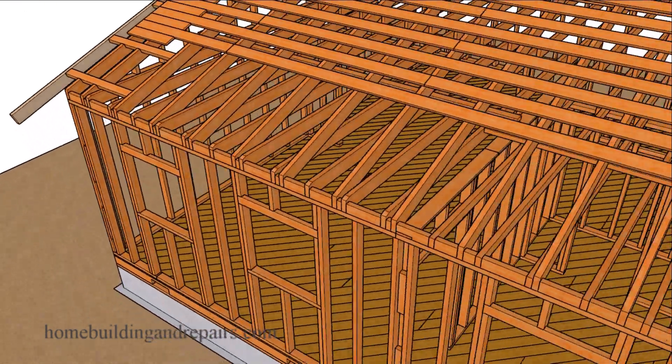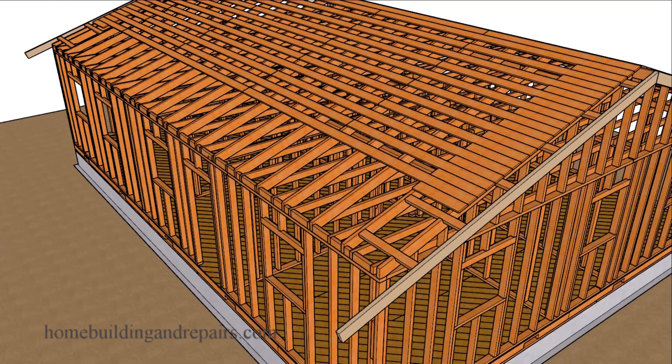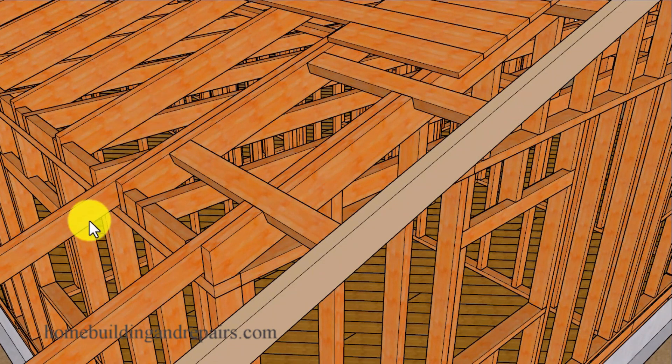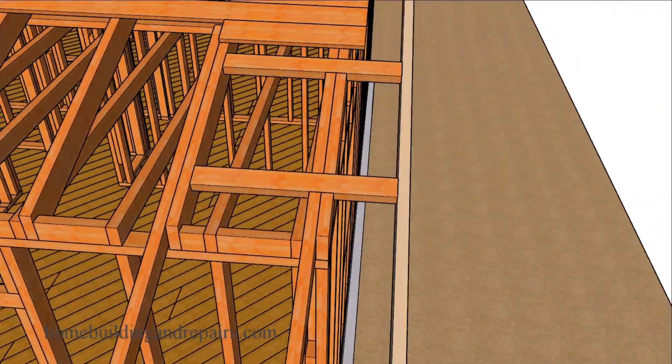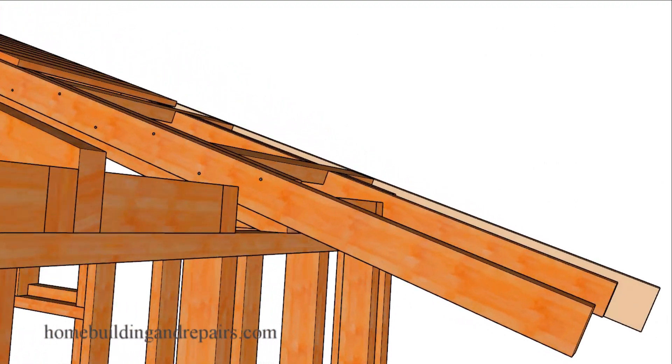You might need to be a little more concerned about expensive lumber prices today. The main concept of this video will be to extend the overhang by attaching another rafter or overhang board to the existing roof rafters. You can see here where we added one to this side and one to the other side, and we attach them with 16D nails.